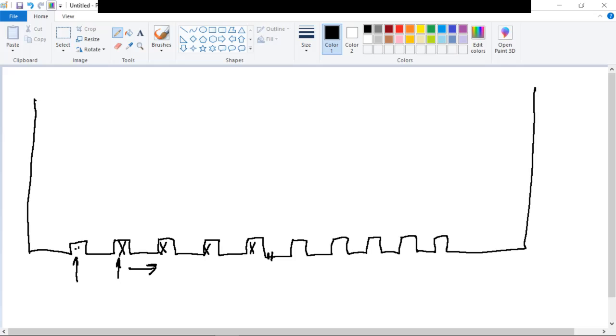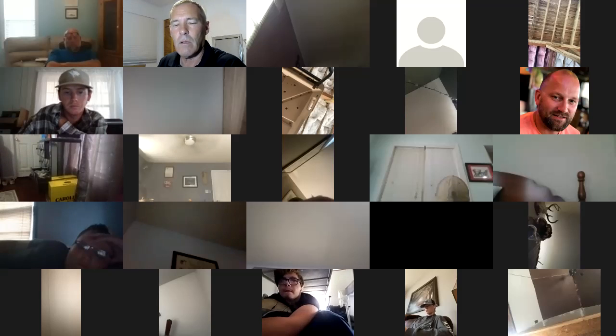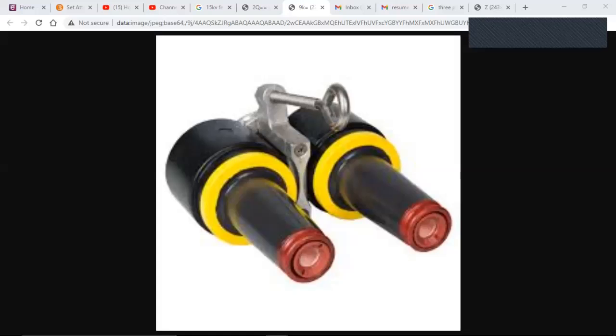That's why we have the feed through. It's going to be a momentary interruption if I need to change this transformer out. As soon as I get A and B off, I'm going to put them on the feed through, and it is removable from the transformer. So I can take the transformer out. I'm going to put them on that feed through right there, both elbows. That's liftable out of the transformer. Once I put them back on that, now I've restored power to the rest of the line. It is a momentary interruption, but not long term.